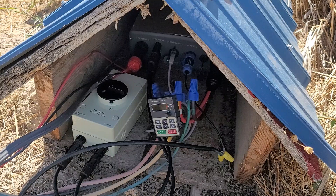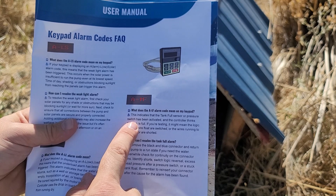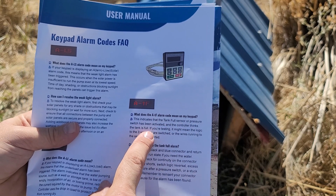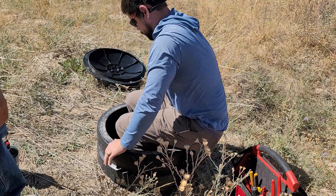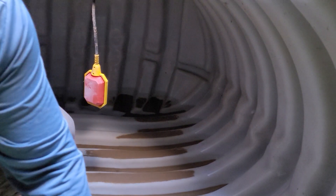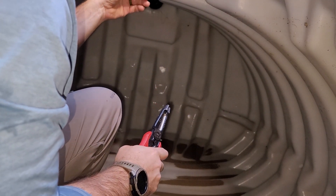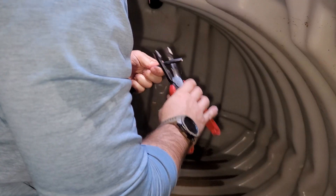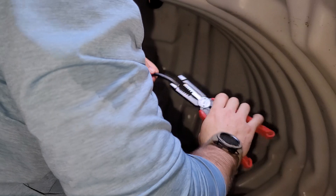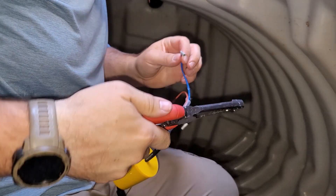I'm getting this ATF failure error, and that has to do with the float. I am using the original float, so I checked the user manual — it indicates that the tank full sensor or pressure switch has been activated and the controller thinks the tank is full. But the problem is the tank isn't full and the float is still dangling. I need it to turn off once the float is all the way in the up position. Since it's an old float and a new inverter, I need to swap the old float with the new one. This is a really small area to work in and I didn't have a lot of cable, but I'm going to strip off the old wiring and casing off of the existing wire — I don't want to run another 75 feet of wire through the ground.